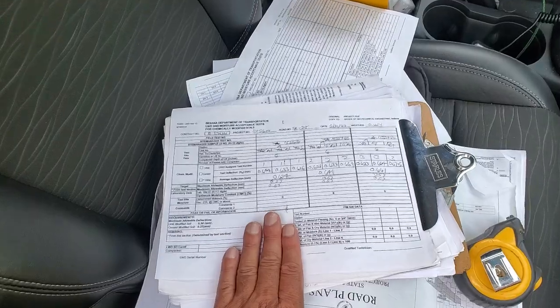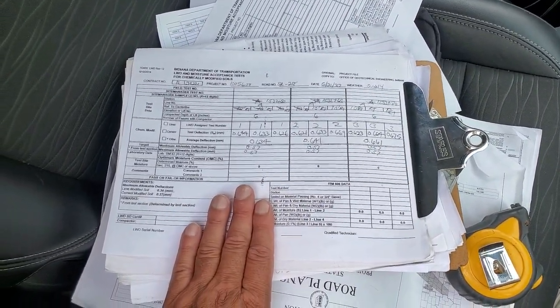Now, what I was doing was actually testing aggregate. And that aggregate is what you see on the ground. This is called 53 stone. Now, the good thing about 53 stone, it's very easy to compact. You see, it looks sort of like flowable fill. It's very hard. Now, this kind of stone, it's generally not 53. This is number 8 stone. 53 is a little smaller in size.